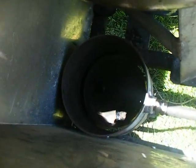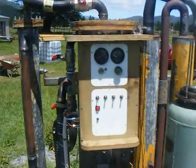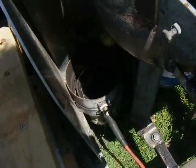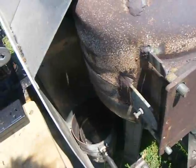There's a spark plug in the burner which I can activate electronically to automate the lighting process, so the gas simply ignites in there and burns quite nicely. The heat from the burner is directed back towards the gasifier, so some use is actually made of it.